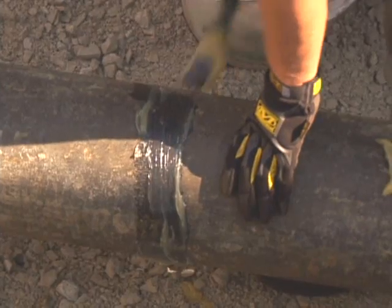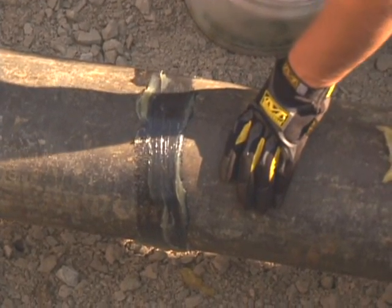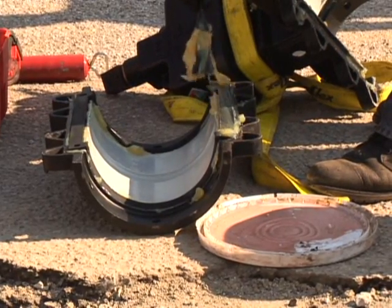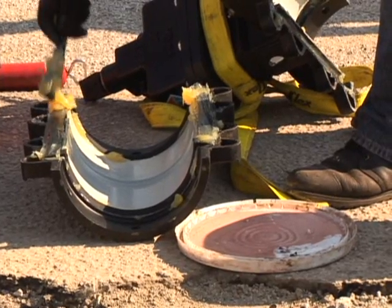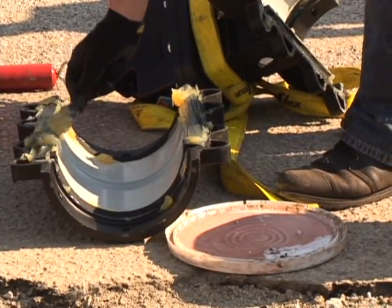The following is an actual installation of the EZ valve insertion system. The AVT technician cleans the pipe thoroughly and coats the pipe and the valve gaskets with a food-grade lubricant for the gaskets to ride on, so that the valve can be easily rotated 120 degrees across the top of the pipe.